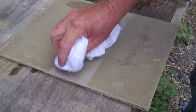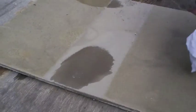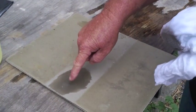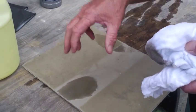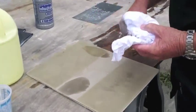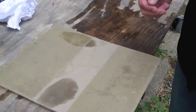The area that's not coated — you can see the delineation in the line — I could get it off, but it took more scrubbing. You can see how the moisture also soaked into the concrete. What that's doing is transferring the acidic material in the fecal matter into the concrete, which then starts to degrade and disintegrate the metal rebar underneath. On the coated side, it didn't get wet — it's just wet on the surface, it didn't soak in. Now the concrete bases of these transmission towers need to stay intact just as much as the tower itself, suffering the same degradation over time from acid rain, bird waste, and so forth.